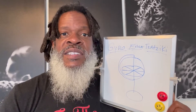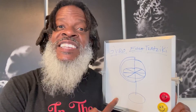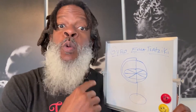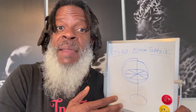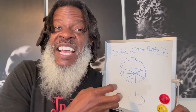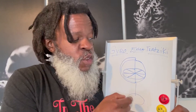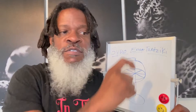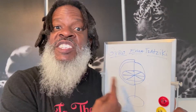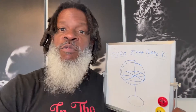Rigidity in space simply means that this device can remain in a fixed position while spinning. If something's rigid, that means it's fixed — it's in that nice fixed position while it's spinning. So while this disc is spinning all around, if you were to lift this up and turn it upside down and do all kinds of fun things, it will just maintain that position and keep right on spinning. That's exactly what a gyro does — rigidity in space.